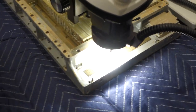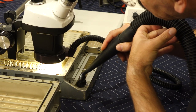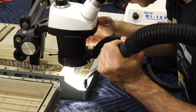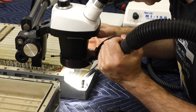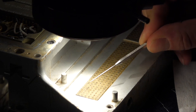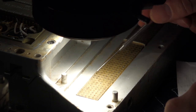Before we can hook up the monitor, I also need to clean a few of the main connector pins. The test connector pins themselves are okay — they were protected by a cover — but the main connector pins look terrible, and I need at least the power pins. I tried vacuuming, that didn't do anything; toothbrush didn't do anything; solvent didn't do anything. So in desperation, I made myself a modified dentistry tool, and that started to work a lot better. I don't know what went in there — it's just this gross-looking gooey stuff.